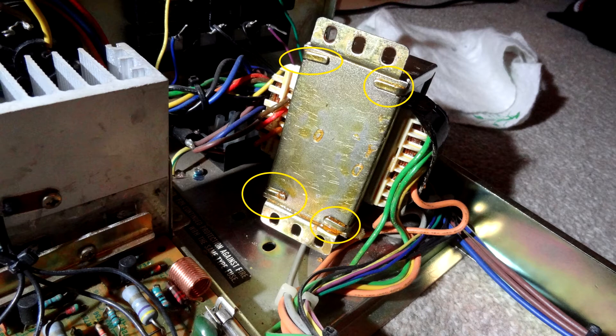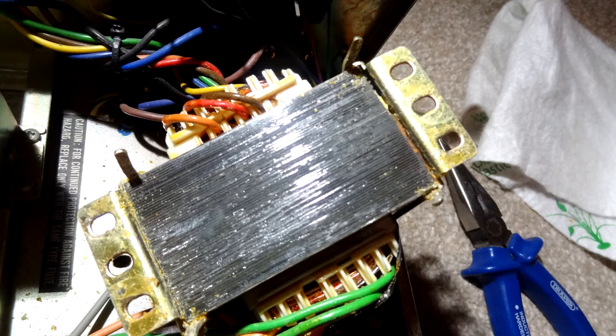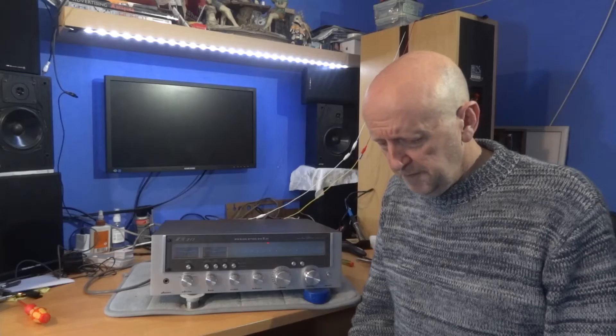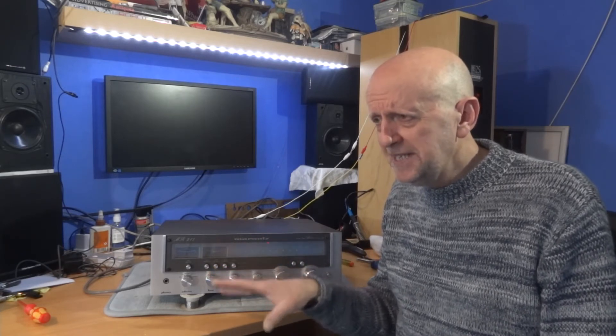When doing these four bent-over clips holding the bottom plate on — there's the clips, just bend them. They will bend and just undo it, and the bottom plate will come off. It may take a bit of prising, but it will come off. Then proceed to do the outer casing — the rest of it will all come off. Takes a bit of prising maybe, but you will get it all off. So let's test it now — we're going to put it in there with a little cloth underneath and test it without that casing on. See if it's the fins making the noise or the casing.